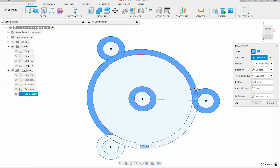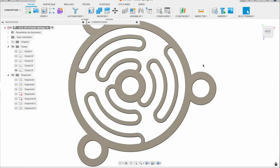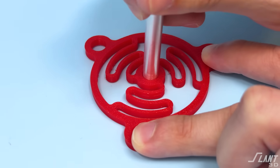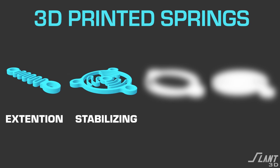There are a lot of ways of rejiggering this because 3D printing lets you create weird and interesting geometries. What if you want just a stabilizer ring? This is something where you would mount something to a wall or a bracket and have the actual item mounted on the inside — maybe a transmission or something you want to vibrationally stabilize. These springs can stabilize in the lateral direction, or serve like a trampoline — kind of like a membrane. This is a very useful type of spring for push buttons, where you can design this so it becomes the big red power button for a box and depresses whatever is underneath.